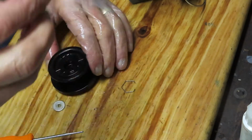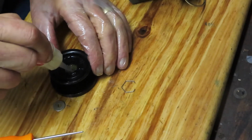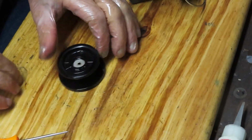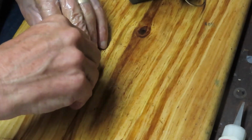That's okay. The felt washers are fine. You just need to keep them oiled. If you don't oil them, they will dry out. And if they dry out, well, they're going to tear. If they tear, well, you can take the rest of it. It's not going to work.